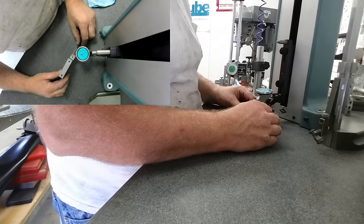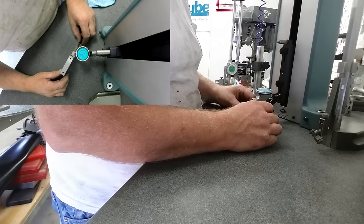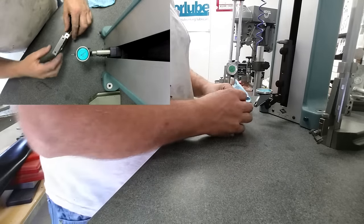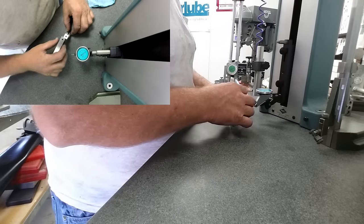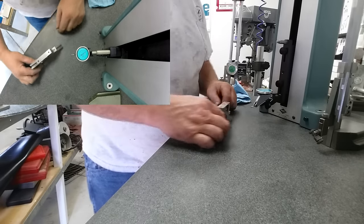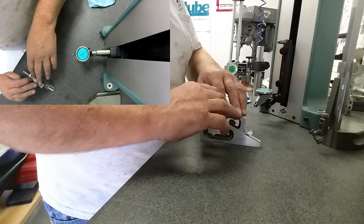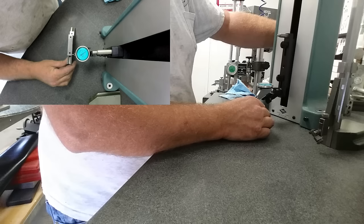Let's get down here and check this little pad down here. That drops off — up, down — it's a little crooked, but not as radical as the top. I'm going to move the planer gauge down to the midpoint. What I'm trying to determine is whether the guide and ways have something wrong with them causing the top to tilt, or whether the top is just out of parallel. So let's check it at the midpoint.